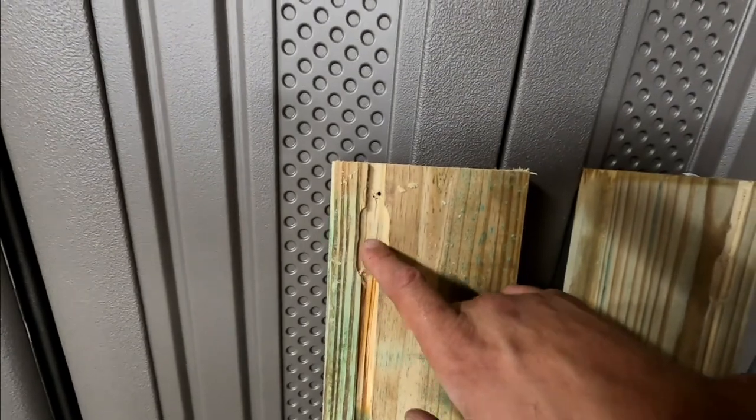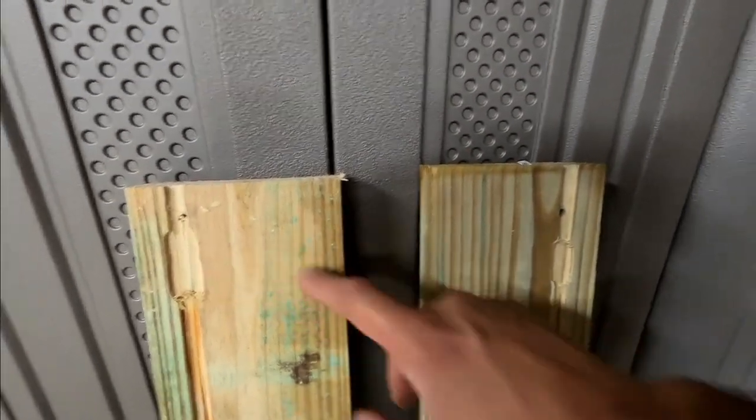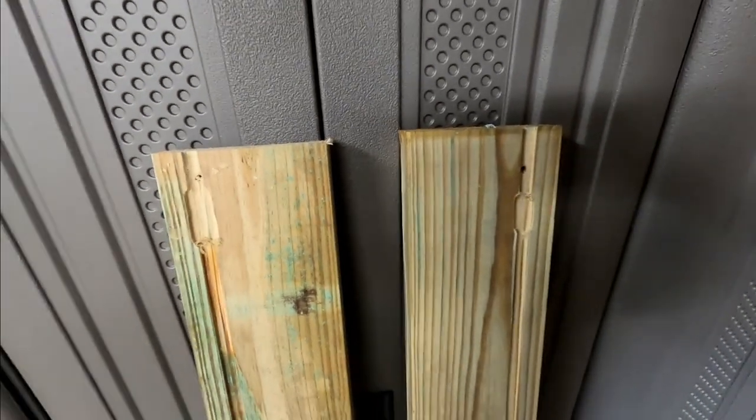One thing to remember when you guys are drilling your holes and routering out those little channels for the extra space for the end pieces, is that you are doing mirror images. You want those slots that you routed out to be on the outside of your bunks. And the wires are going to be dropping out of the back of the trailer, right at the back of the boat. So when you do this, make sure you have a mirror image going on here. There's the holes, there's a slot for the router, slot for the router, and they're on opposite sides of each other.